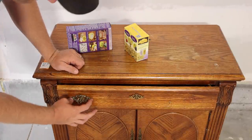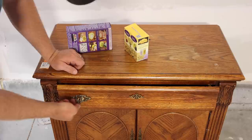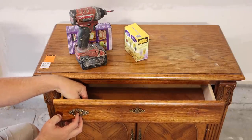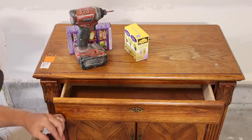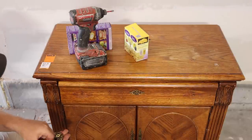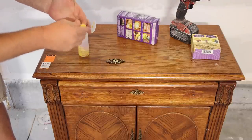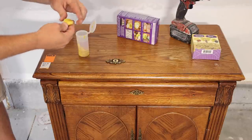We're missing the back plate on this one completely — that's gone — and this one's bent. So we're going to replace this little knob portion here; it's held on with a couple of nails. I'm just going to pry this off, save those nails because I need them later, and we're going to make a mold out of this. A couple of weeks ago we showed you how to use the Amazing Mold Putty to add detail to a piece; this time we're going to show you how to use it to replace broken or missing pieces.